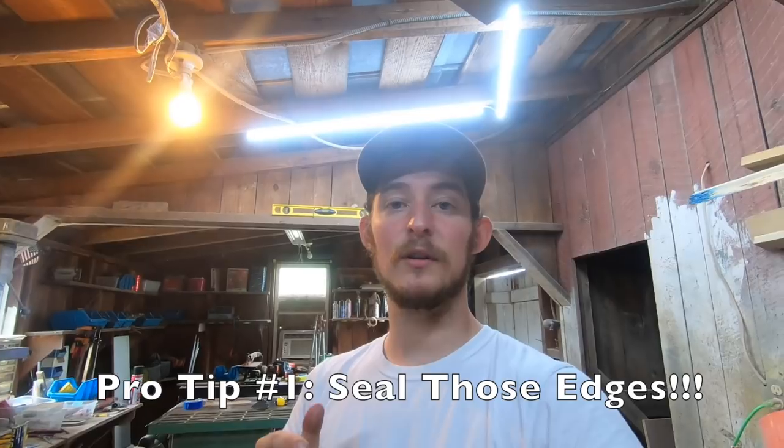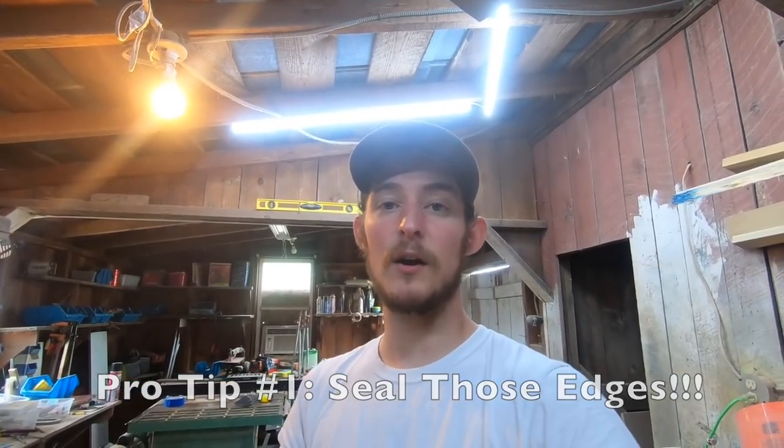All right, guys, today in this video, we're going to go over two things that I continue to get questions about that maybe I'm not specific enough on, and I have also seen issues in this department when people are sending me questions about their projects. So step one is to seal the edges of your work so that you don't get air bubbles, especially when you're doing a river table or are casting a slab. I'll show you exactly what that means.